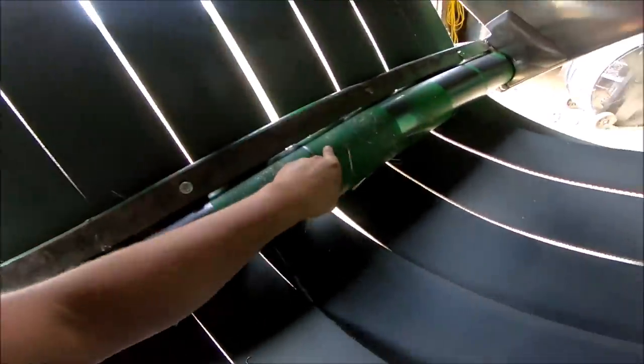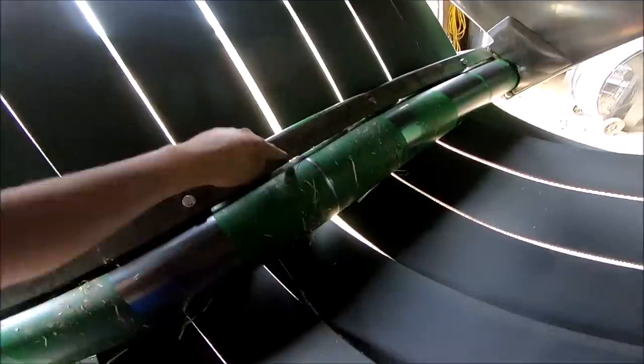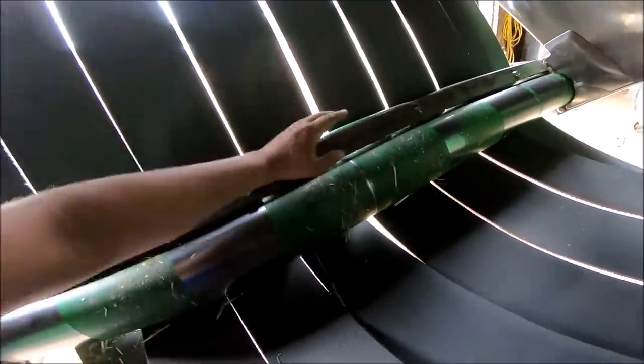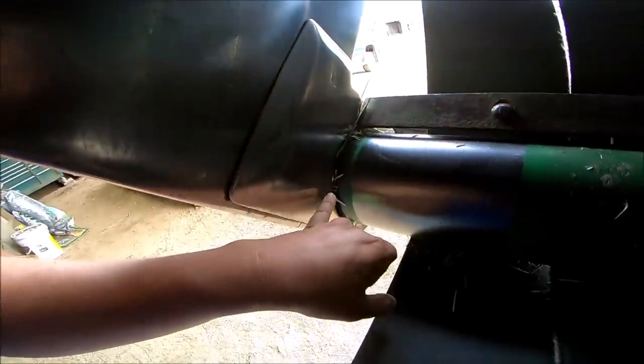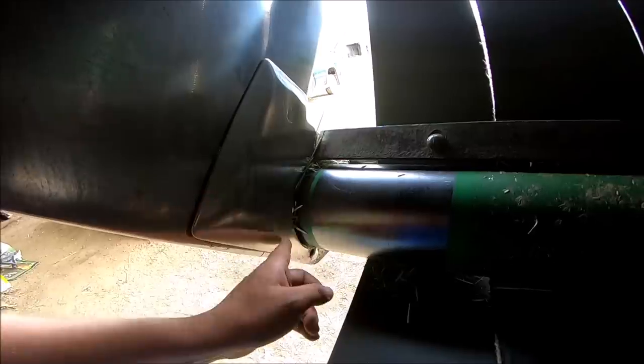This bar here is the same bar that's sitting over there - we ended up hitting it with the torch and sledgehammer and beat it back into submission. It's still kind of bent because when that roller broke it jumped back and kissed this bar right here and put a good bend in it. Also, these wear plates right here - that one's cracked and this one is ready to let loose. You can see how much is worn off of it, so I got those coming.